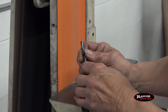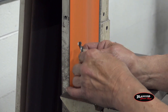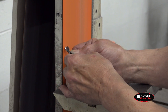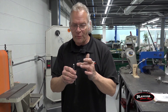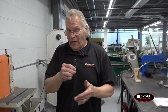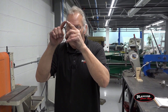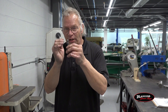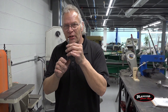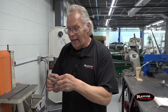Once you get used to it, I kind of like to give it a little bit of an arc, a little bit of a radius, which seems to help in softer material. Then just check it on your drill gauge for your point centering and that you've got the angle right. You may have to put it in the drill gauge five, six, seven times, adjust one side, then adjust the other. It's not so much about the perfect angle — if you're off from the 118 a little bit, that's okay — as long as you've got both sides the same, both tips hitting the inside of the drill gauge, and the center is in the center. Make sure you've got some relief, the right angle, and both sides are equal.